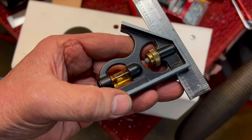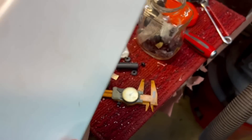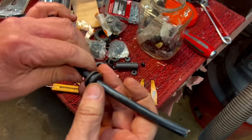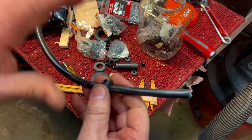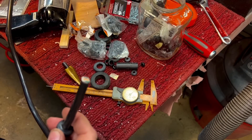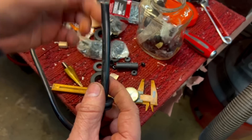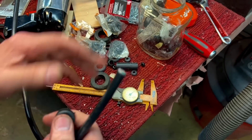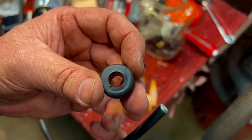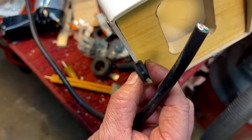One more hole to make — that's back here for the power cord. I decided to use this heavy duty cord. I want to put a grommet in — a grommet is an interface between the cabinet and the cord. You just don't want to drill a hole and have the cord hanging out bare. You can use a piece of rubber hose as a strain relief, but a grommet is very professional. You buy them in kits — best to buy an accessory pack with a bunch of them. You have to make sure the thickness of the grommet matches the thickness of your cabinet so it fits in nicely. We have a good match.